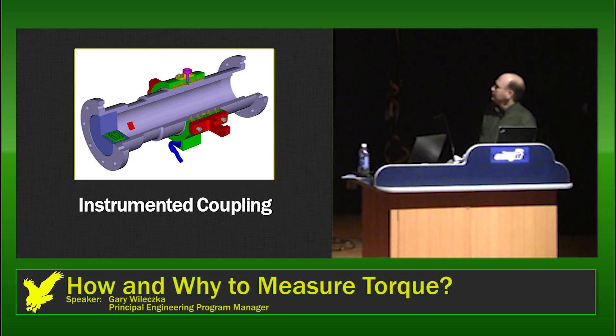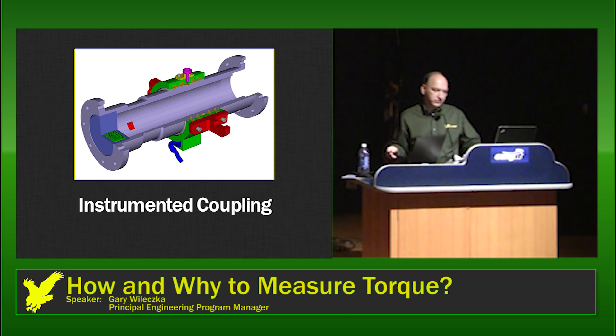Here's a representation of a coupling with a rotor-stator arrangement. There are windings in the stator, which is the stationary part, and also windings on the outside of the shaft, which is the rotating part. These windings form basically rotary transformers — one stationary and one rotating — so we're able to get power into the coupling. Electronics mounted at one end power up the strain gauge. The strain gauge gives a small output, the electronics amplify it and convert it into a different kind of signal that can be passed out through the rotor and stator to external electronics.